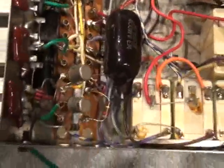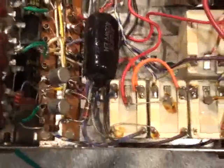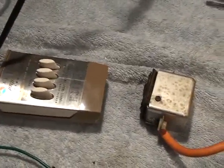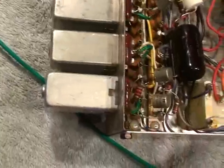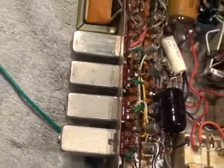Like I said, we're going to take the probe from the scope and put it right on the collector lead to the transistors. We simply press the button for the corresponding frequency, and we're going to peak out each of these detector coils for maximum response on the scope.